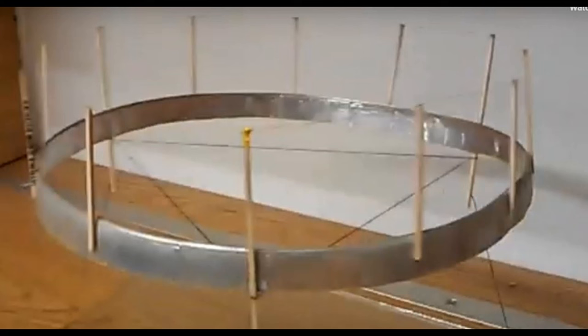This is possibility number two. It's ion wind. This is an ion wind lifter. It has a high voltage wire on the top, aluminum on the bottom. Positive goes to the top, and negative goes to the aluminum on the bottom. Now, it also has to work with a sharp edge on the top, and then it has to be a rounded edge at the bottom where it starts, and then as it goes down, you can get any kind of crazy you want, and it'll still work. However, it still works between two high voltage fields. Like I said, the high voltage is a flyback transformer to get this one to work as well. The wind is created between the top wire and the bottom aluminum, and it forces the item to go up because the weight is reduced enough that the wind will actually propel it up. Is this a possibility of what's going on here?